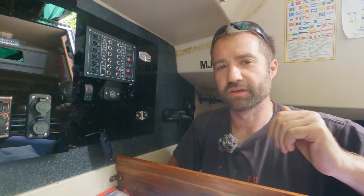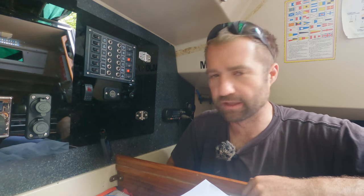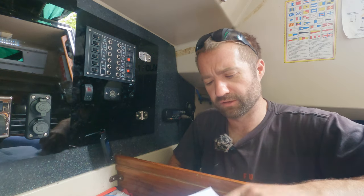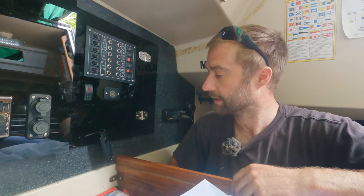Tell you what, why don't I do a novel thing and have a quick look at the instructions and then we'll try again. Right, so, instructions perused, shall we say. Managed to get the pump primed, which I think, yeah, I had to press some special buttons on that. Also, weirdly, it stopped working and there's an inline fuse near the heater and it had actually blown, which is kind of disconcerting. But when I looked, it was a 5-amp fuse and in the manual it says 15 amp, so hopefully that was the reason why.